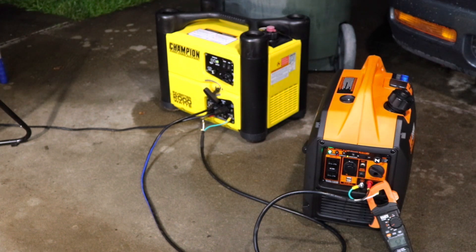I have it hooked up in parallel to this Winco, a newer style inverter generator that automatically detects the voltage when starting up. I tested to make sure it worked — as long as you start the Champion first, get it running, and then start the Winco, the Winco will sense the voltage, hertz, and frequency of the Champion and match it and start running.